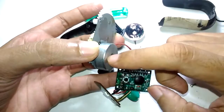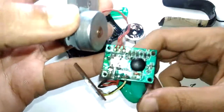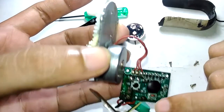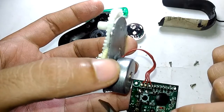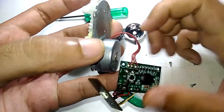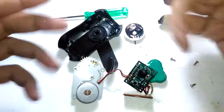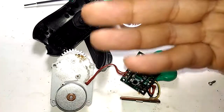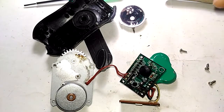To summarize: the dynamo rotates when you crank it, generating three-phase AC which gets rectified by the diodes. That's used to charge the battery, and when you press the switch, the battery discharges straight through the LED — also through a resistor connected to the LED terminal. That's what's inside a 700-rupee Decathlon-sold torch. Thanks for watching, see you in another video.